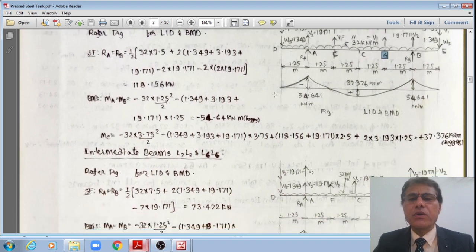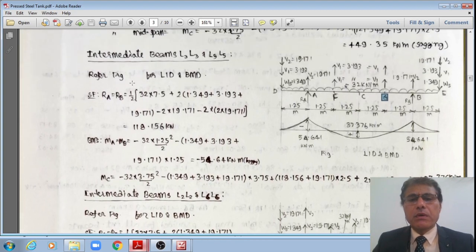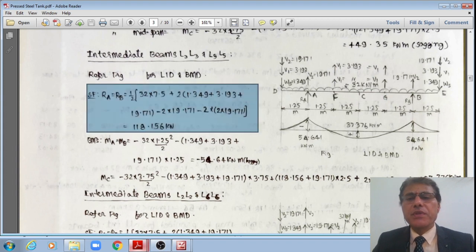different locations. I want to find out what the shear force ordinates as well as the bending moment ordinates are, so that I'll get the maximum shear force and maximum bending moment. Now, because this loading is symmetric, I can say that the reaction is half of the total downward load acting in the downward direction, which is half multiplied by 32 multiplied by 7.5 plus 2 multiplied by 1.349 plus 3.193 plus 19.171 minus the forces acting in the upward direction,